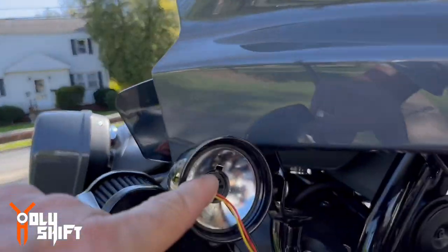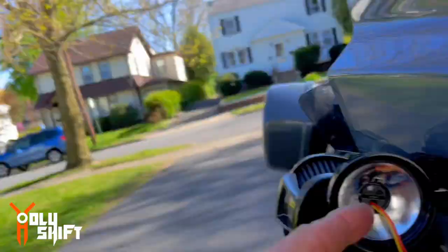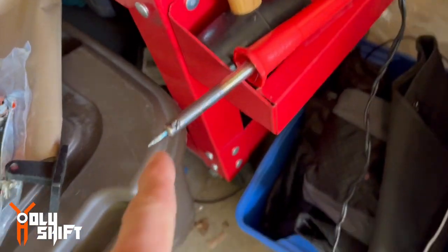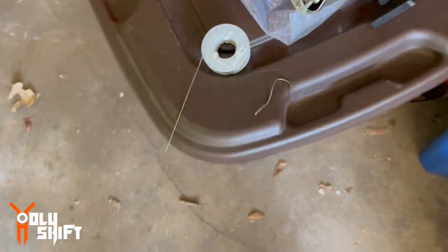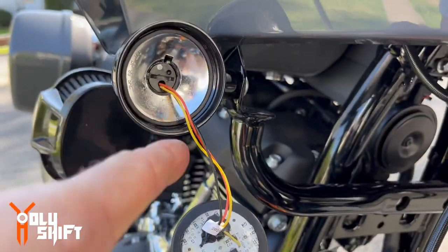Let me share a small secret. These wires are very sensitive — do not pull on them. I think when I was trying the bulb in and out, I pulled a little and the black wire disconnected. I had to go back and use a soldering iron to open up the little housing and fix it. My point is: treat these very carefully and very gently. So now it's working.